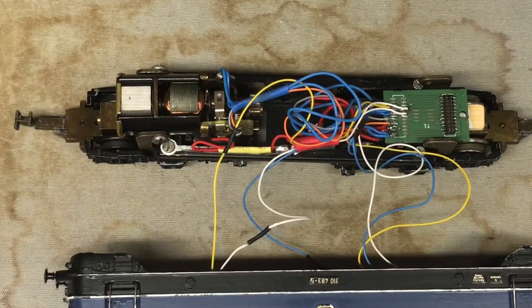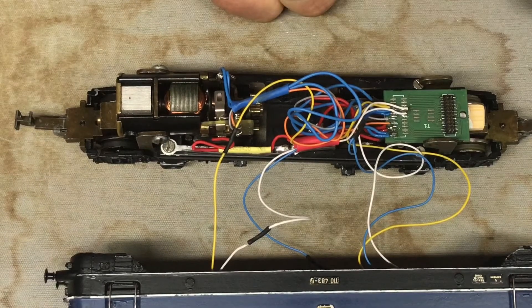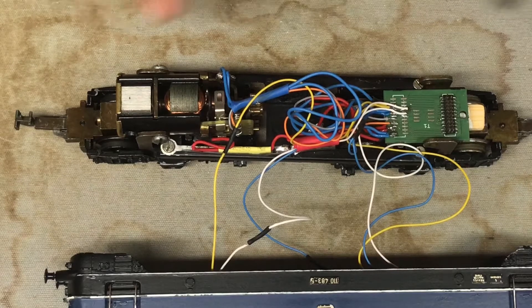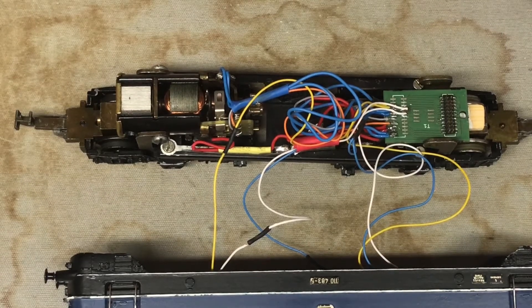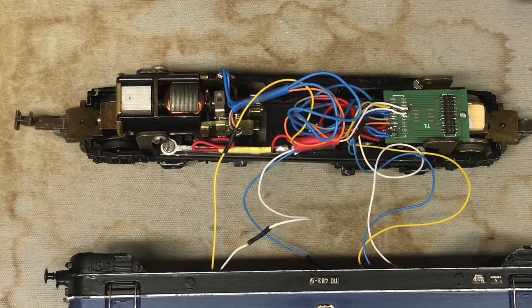In the meantime I am now further along. The circuit board from Lars Prönen of the company Prönen Modellbahn has arrived, and I have soldered it nicely according to my plan: I am running a Rangier light - white front and rear - and I am running via AUX 1 and AUX 2 white and red lights. That means rear is always red alternating with white front, depending on direction of travel.